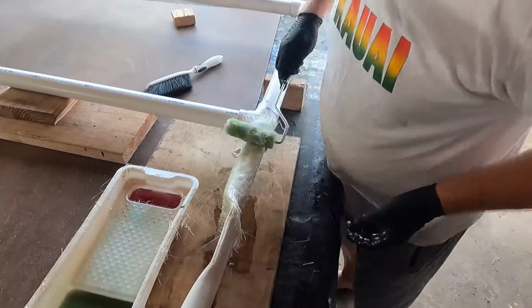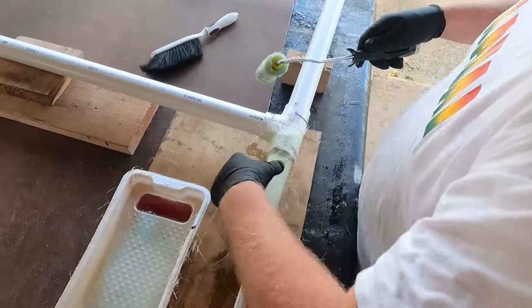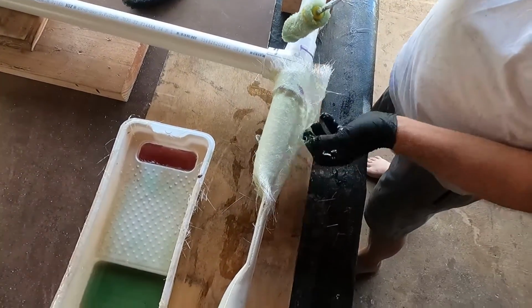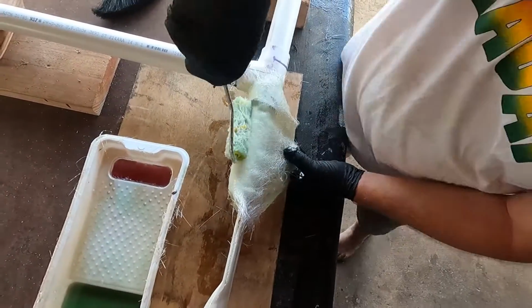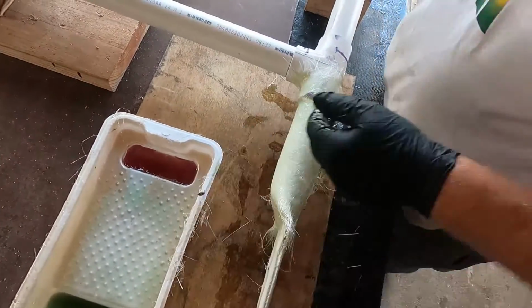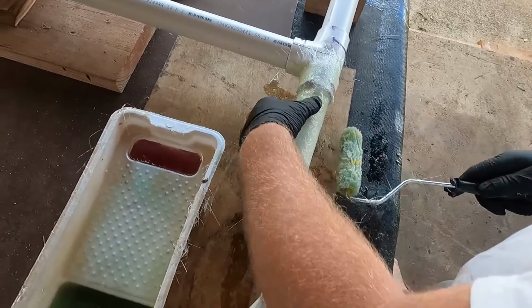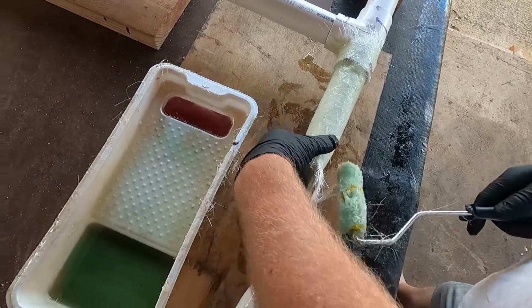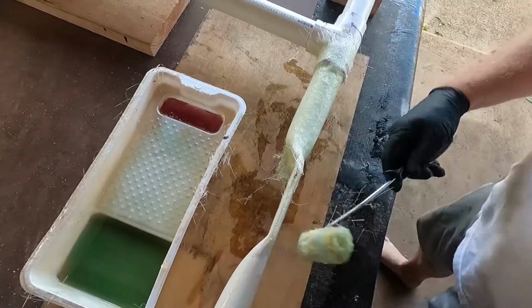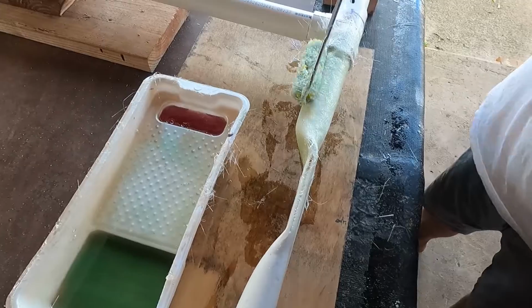And then, of course, the resin works with the fibers to create a composite material. And that is essentially 1 + 1 = 4. You get a really, really strong material when you combine the resin and the fibers together. Kind of like using manure and straw to build houses, you know, many, many hundreds, if not thousands of years ago. That was the technology. Today, we use rebar and cement and other things for composites. So fiberglass is a composite, fibers and a resin.